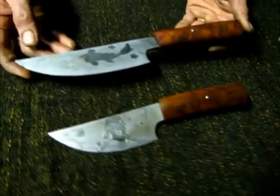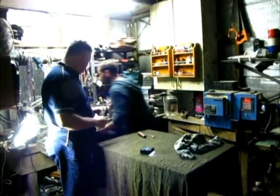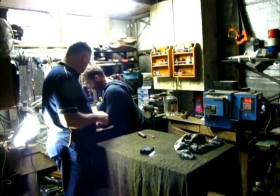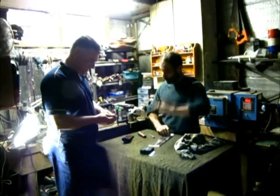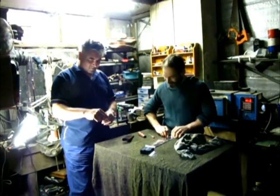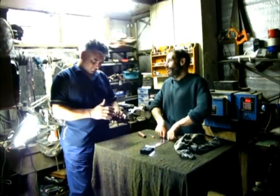Yeah. So going in at 1050 for 8 minutes. That's what they say. It's like cooking. You don't think, you just stick to the recipe. 1050 degrees for 8 minutes. And then in the kitchen oven at 220 for 2 hours.